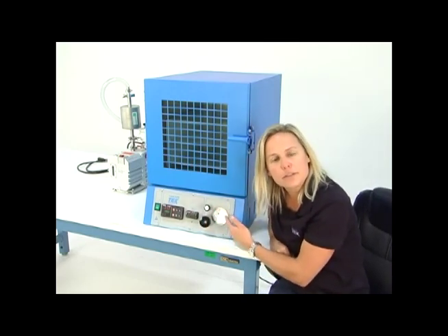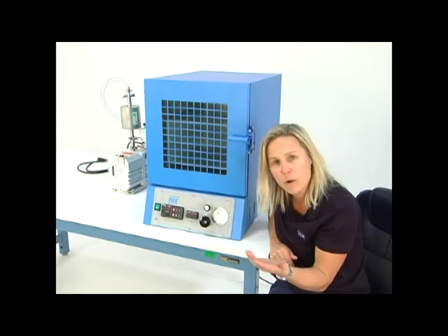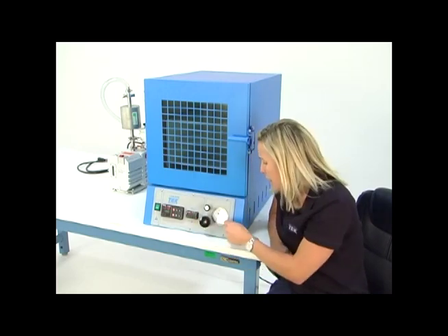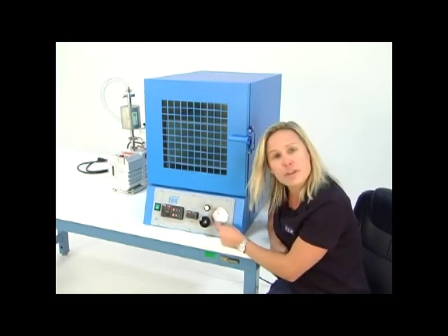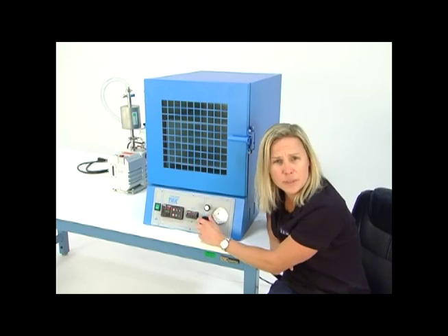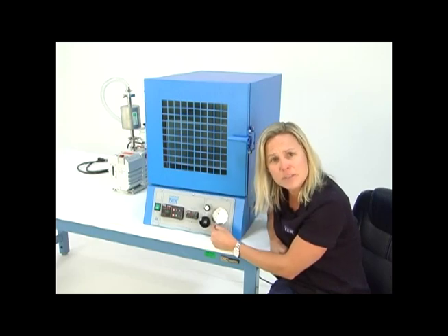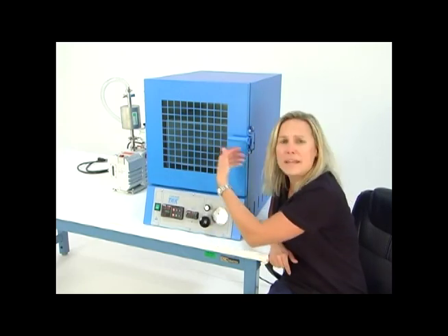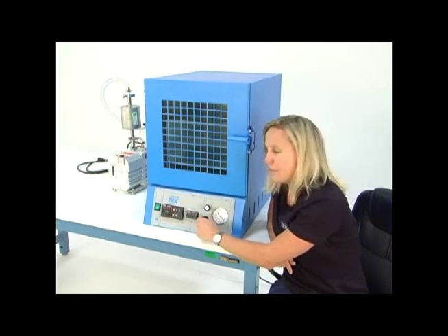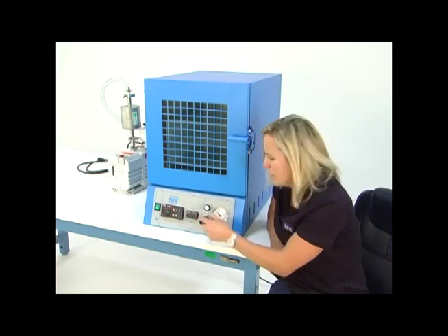This circular gauge right here is your vacuum gauge. It reads in inches of mercury. When you're pulling a vacuum — your vacuum valve is open, your pump is on, and you're pumping down — this needle is going to go over to 30 relatively quickly. The pumps and connections we use are robust enough that if it doesn't get there quickly, something's wrong. You either have a leak or a tremendous amount of gas load inside the oven. If you want to not pull as much of a vacuum, you can back off on the valve and play with that a little bit.